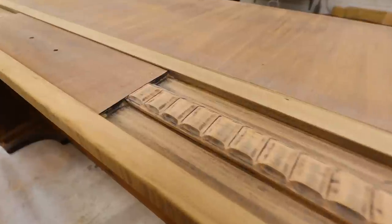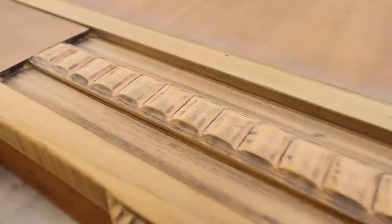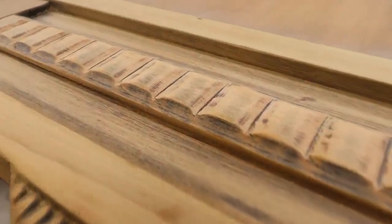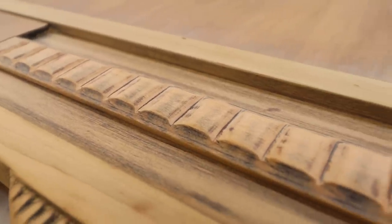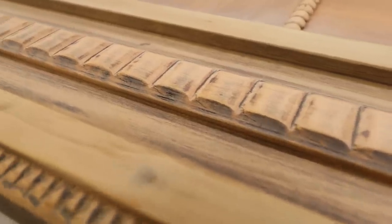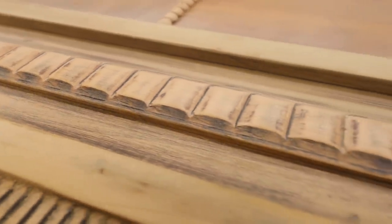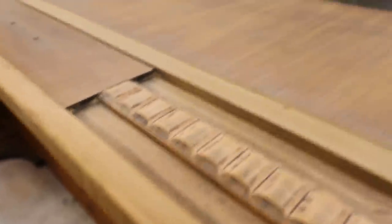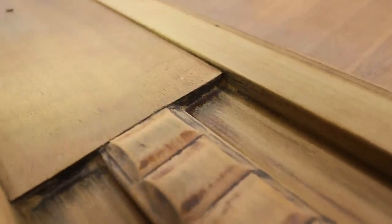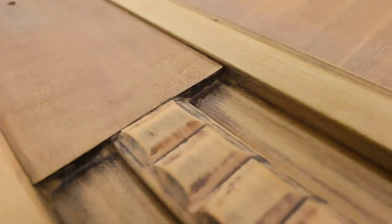One little trick here I gotta show you. When you do this, if you can see this here, pretty good. Pretty much the key is just to get anywhere you see a shine, just to knock that down, because that is, you know, leftover finish might be a little bit in there, gotta get that out. It's all pretty good. Use my light on my phone here. You can see a little bit of the reflection down in there. There's a little bit of finish left down in there.